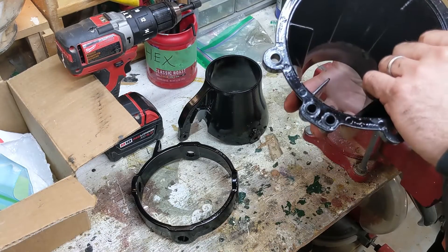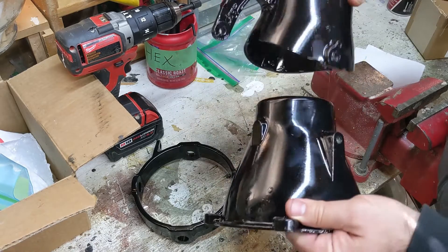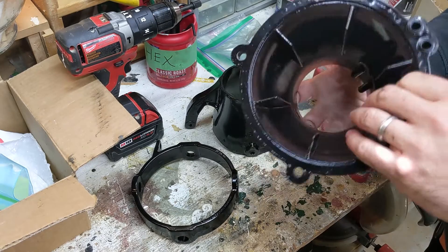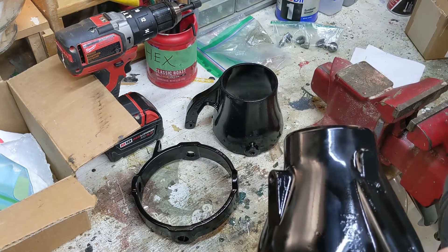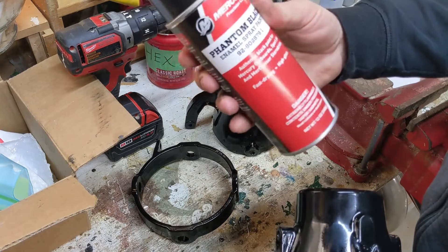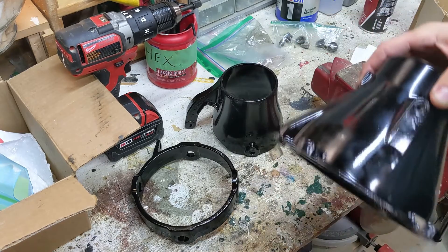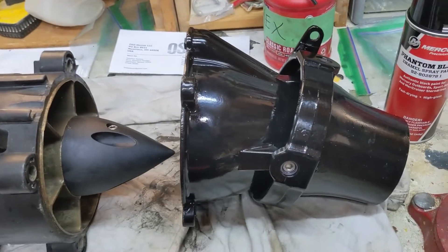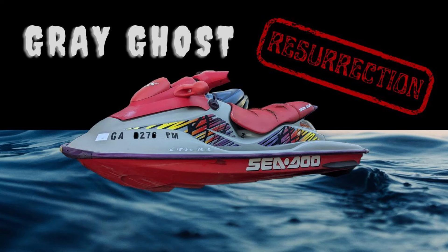In addition to the pump, I also worked on the steering nozzle — the three-part aluminum piece. It had up-and-down and side-to-side motion and was pretty scratched up all the way down to the aluminum, like it had been run over rocks. So I went after it with a scraper, wire brush, and sandpaper, cleaned all that up, primed it, and painted it with Mercury phantom black epoxy paint, which is really good stuff — a little expensive at about $20 a can, but it really turned out great. This finishes up this part of the project — a lot more to go, but stay tuned for another episode. Thanks for watching!